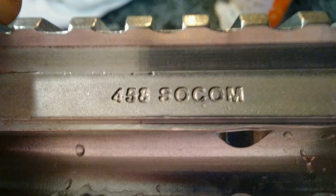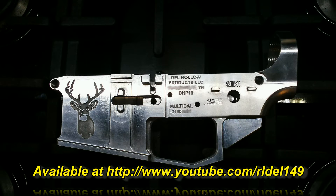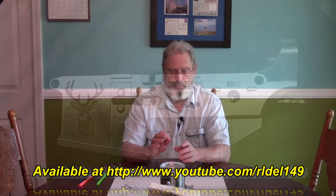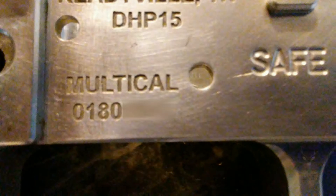On my second attempt, when I was doing typical maker text — a model and a serial number — I had the same situation, some dots that wouldn't stay. This is 10-point and 11-point Arial, which is pretty darn small. It is as small as I can practically pick with a tool like this. Now here's the thing: we're going to naturally widen out as we etch. One might think, let me get my lines as close together as I can — yes to a degree and no to another degree, because the thinner you get, the harder it is to take that little pick and get it to come on up. It will widen out and you need to be aware of that as you go deep.